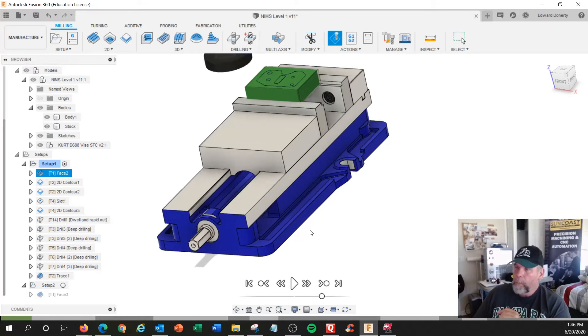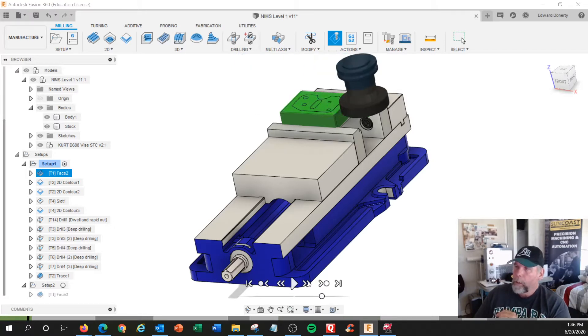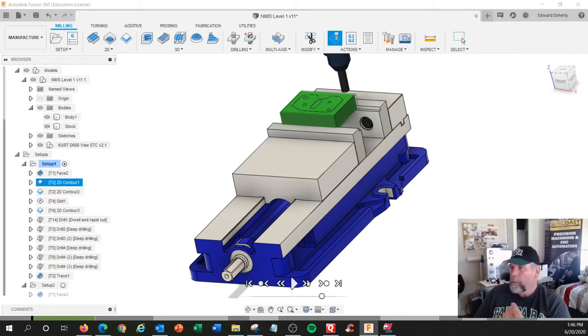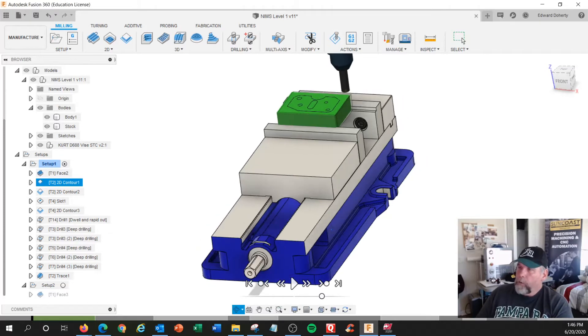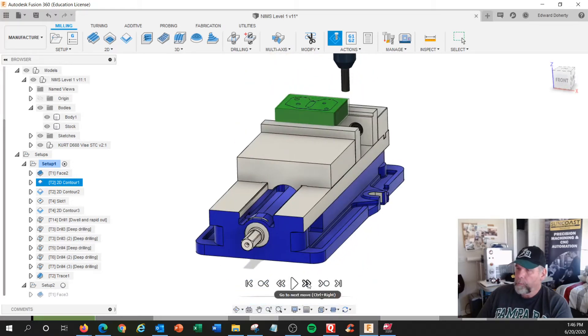Let's zoom up a little bit. I'm going to bring it down to the Z zero position and start cutting across. Then get out of town, go home, get another tool. Now we've got our bigger end mill — I like using a half-inch three-fluter. You have to come down clear of the material; that's going to be your entry point. You're going to rapid to there and feed to the depth you want.